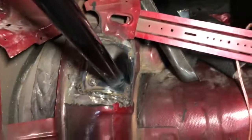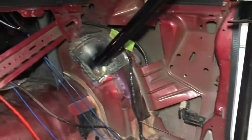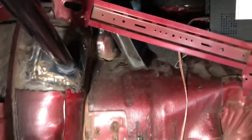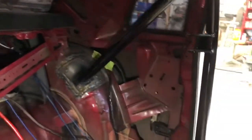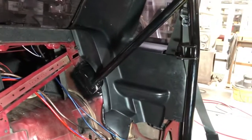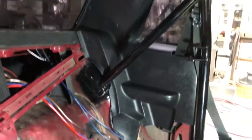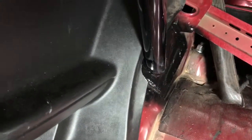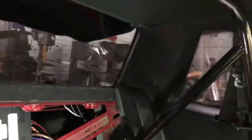Tomorrow we're gonna stand this thing up and weld it to the car. We got both supports welded — pretty difficult welding in a tight spot like this — so we're gonna squirt some paint on there and get started on the seat delete, fitting the side panels and seat belts back in. Just got to button up a few things. Got the side panels back in, got the factory seat belts back in. If anybody's doing this job, you gotta notch the panels just a tad right there for the roll bar.